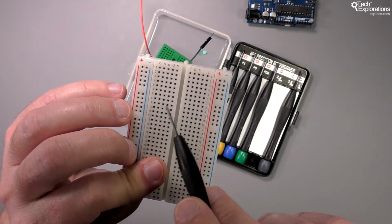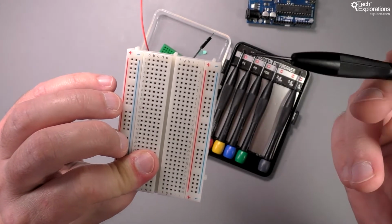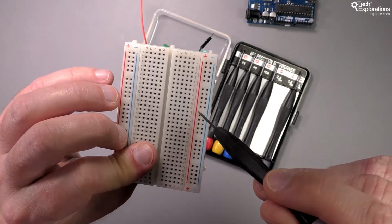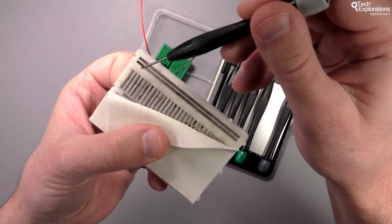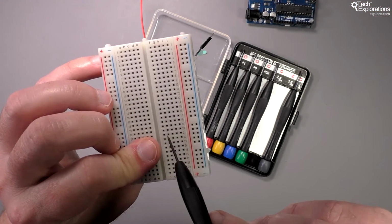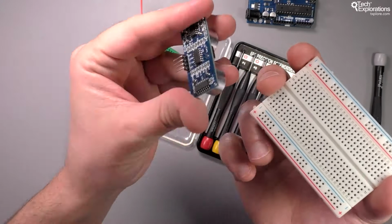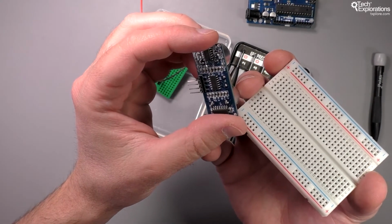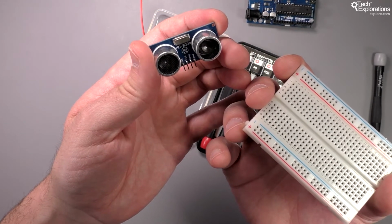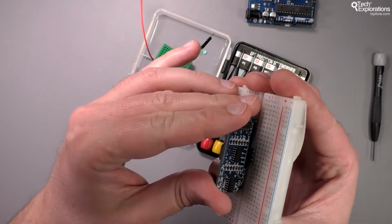So if there are components like transistors or LEDs, for example, that need to draw power in order for them to do something useful, then using a breadboard like this, you can conveniently apply power to these 2 columns. You can see that they're all connected horizontally this time, and then you can draw power from these columns directly. So for example, let's say that I have this device connected to my breadboard. This is an ultrasonic distance sensor, and I've got a whole lecture explaining to you how to operate one of these sensors. So let's say that I plug it just like that here.